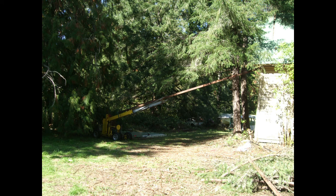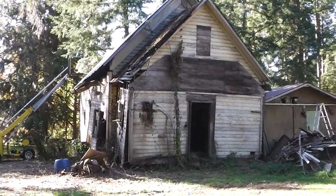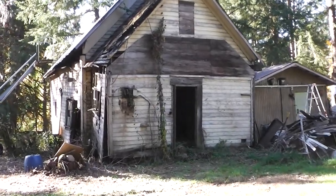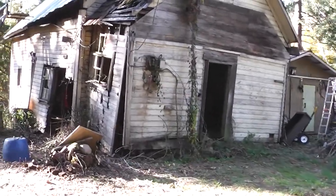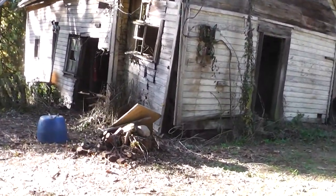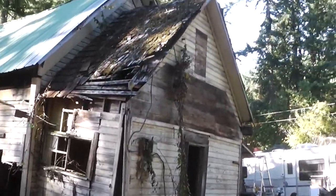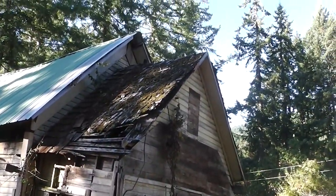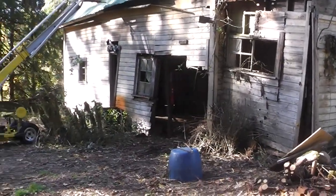Here it is installing a long beam — they're 32 feet. Here it is pushing the beam in, lifting it up, and then pushing it through the end of the schoolhouse. Here's the video of the schoolhouse after we've installed the big metal frame. You can see it looks really dilapidated, but amazingly the problems are not with the roof structure — they're with the walls and the foundation, or lack thereof. This front section is actually newer than the rest of the house.